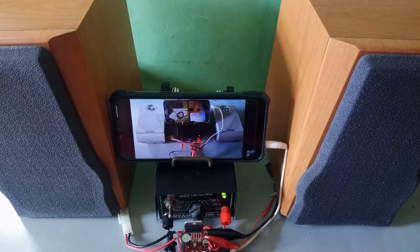We have an output, we have an output — we don't have output on the other one. It has a light here on this one, but this IC is not working. We have another IC: TL494. The ground pin is pin number seven. Let's check the output — pin number two, pin number 12 — green light, good.